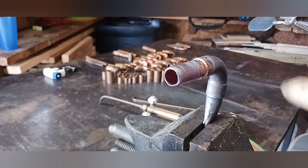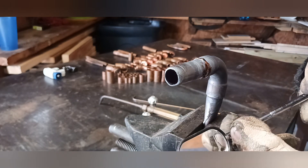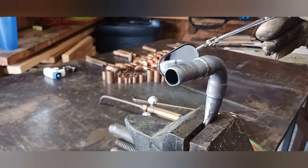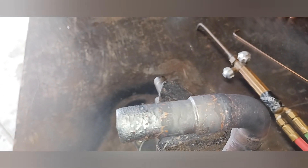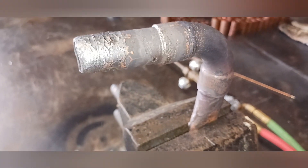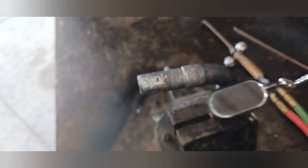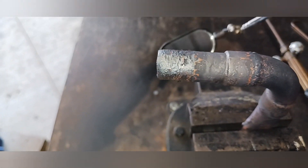Here I'm shaking my finger indicating that you are not done without checking with the mirror — you always want to check with a mirror. It will save you a lot of time down the road. I don't care if you're a veteran, 95 years old and still brazing pipe — you should always check your brazes with a mirror, because there are going to be pinholes that pop up. You'll try to pull a vacuum and waste a lot of time. You may also pressure check with nitrogen to see if there are any leaks, but using the mirror will save you time regardless.